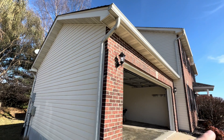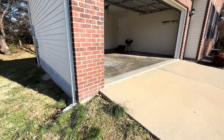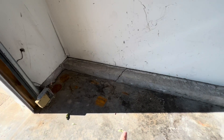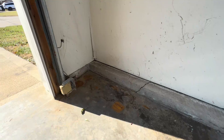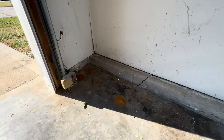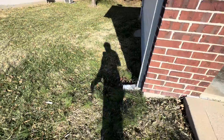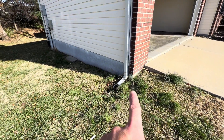This is pretty much a safety hazard because this whole chunk of brick wall could just come tumbling down — it's completely detached. Going inside, you can even see on the foundation around the garage where that step crack is from the settlement. And this is all just because they didn't put extensions on their downspouts, or the extension wasn't long enough, or had a hole in it.